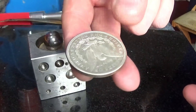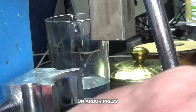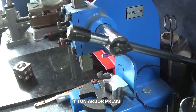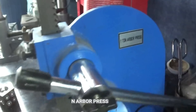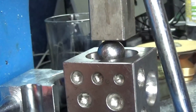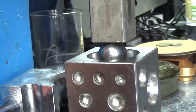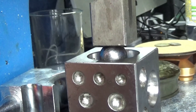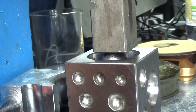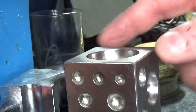This is the one-ton press — a lovely piece of equipment called an arbor press. You can find links to the best prices on my blog. The six-ton is about £60, but this specialist press costs more. I'm going to gently push that now. The coin has been annealed so it's even softer, and silver is soft anyway. I'll check it to make sure the first fold is level and not with a flare or a wobble.